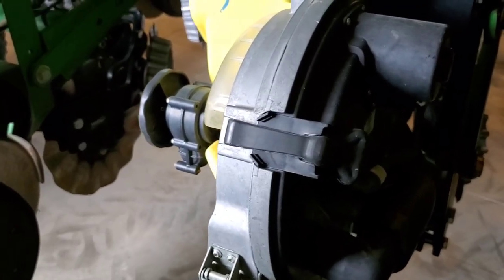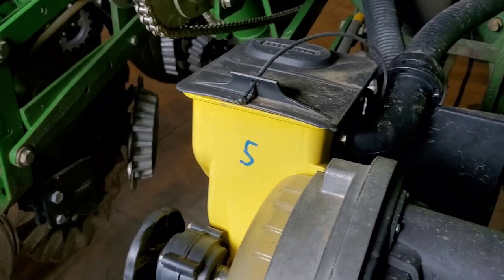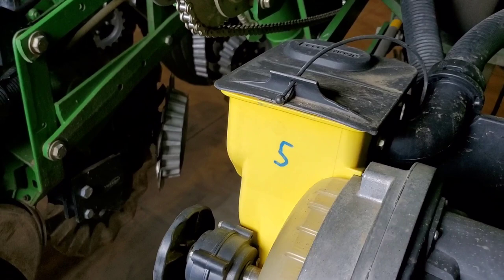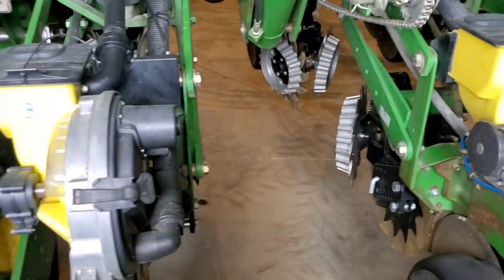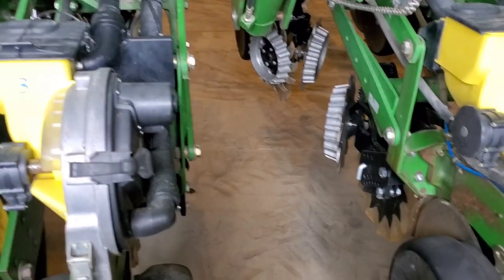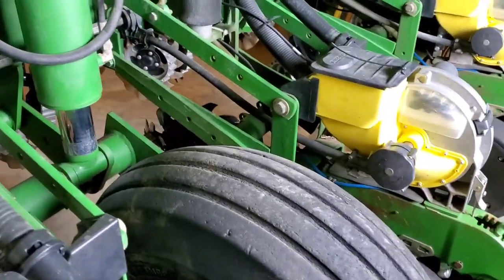So if you're looking at a 1790 planter, this is something I learned the hard way. Go ahead and comment below, or even ask me. If you wander into one of these planters blindly, you can end up costing yourself a lot of money. Had this had the original SeedStar version with a 4.5 volt CAN system, then you went to hook it up to a new, say, 8R tractor with a Gen 4 display in it, you would have an electrical nightmare. It wouldn't even be a compatible system. You run 2.5V versus 4.5V, nothing would jive. And you'd probably cost yourself another $20,000 just getting it hooked up.